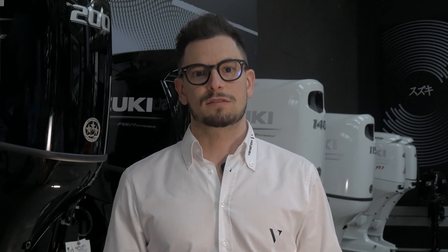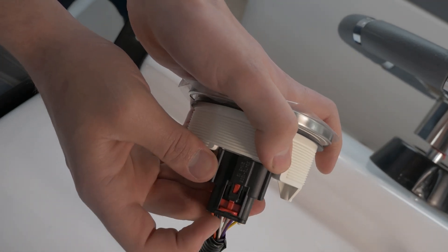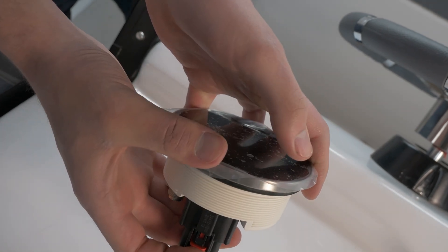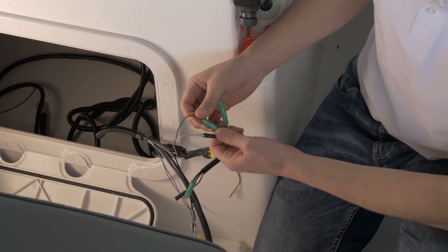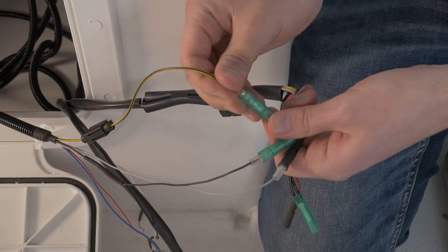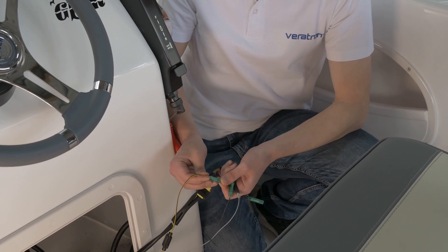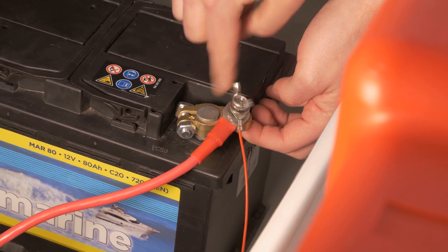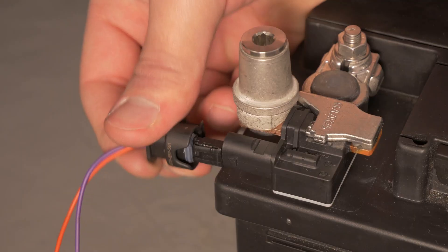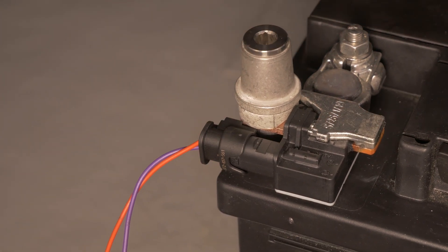The provided wire harness brings everything together. On one end we have the watertight connector for the display, which is plugged and secured with the safety lock. Just after that, we have all the connectors required to easily interface both the power supply and the analog tachometer and trim sensors coming from the engine. On the other end of the 6 meter harness, we have the connectors for the IBS — respectively for the sensor and for the positive terminal of the battery, with an inline water sealed 3 ampere fuse.